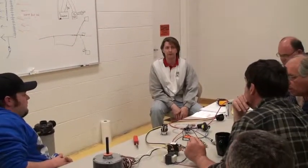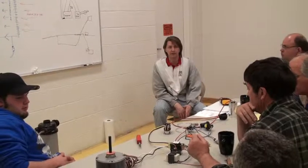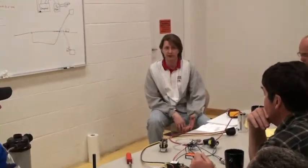Alright, so get as much information from your customer as you can. It'll help you save time in the field, and it'll help your customer. If it's just a water issue or a breaker that's tripped because there's a lightning storm, their pool will start heating 3 minutes later instead of, say, you can't get out there for 2 days.